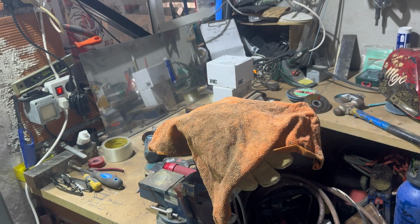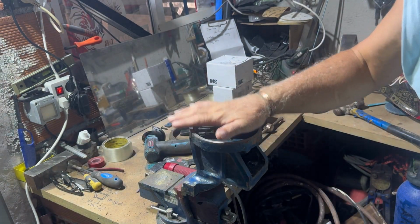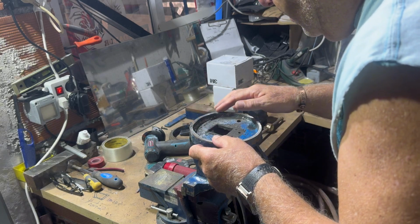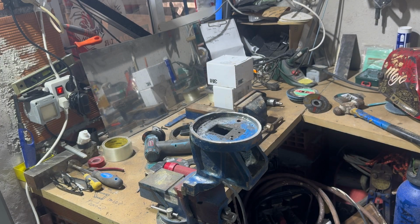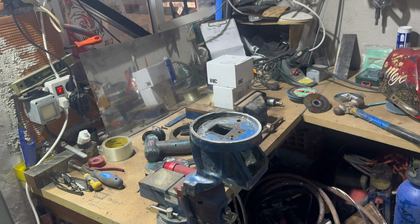Right then, let's have a look and see where we are with this. That's cool. That's at ambient temperature. Okay. Surprisingly, we've got no cracks. Now then, this stuff is not very nice on the old lungs. The graphite off the rods, the nickel, the fumes, the vapour. So I would suggest wearing something like this at the least to do it.